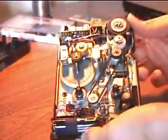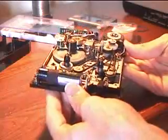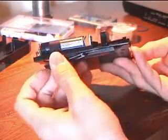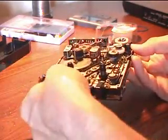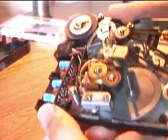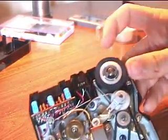The mechanism, though, on the inside of this apparatus is very interesting. It uses one AA battery to supply 1.5 volts, which will run a tiny little stereo preamp circuit board. And the audio will then go to this head thing here where the signal fluctuates magnetically. That then gets picked up by the playback head in the 8-track player.